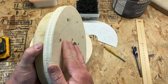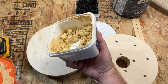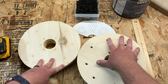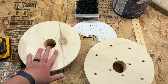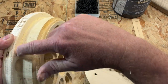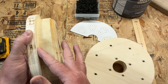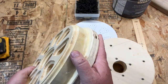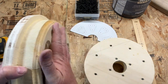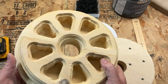Once you've got it to this point, I used a little bit of wood filler — I keep throwing water in it to resurrect it, it's miserable, but waste not want not. Fill in the backs to get them nice and flat; we're going to be painting over it so you won't really see the back — it's kind of an extra step. But on the front you want to use some wood filler to fill in any gaps and go around the edge — the main reason is it stops water getting in. This will weather really well once it's painted; you want to try to prevent as much damage as possible. You're going to build four of these, and this is why I'm saying it takes a whole bunch of time.